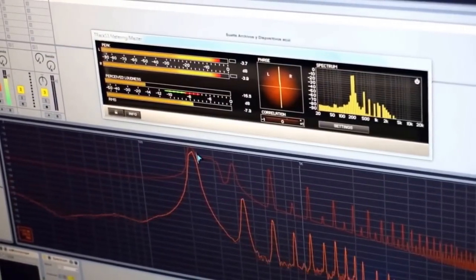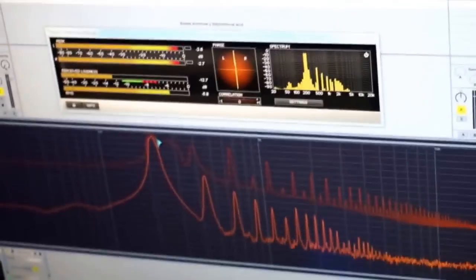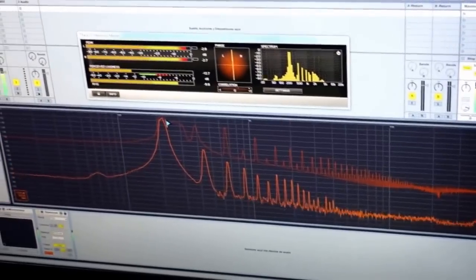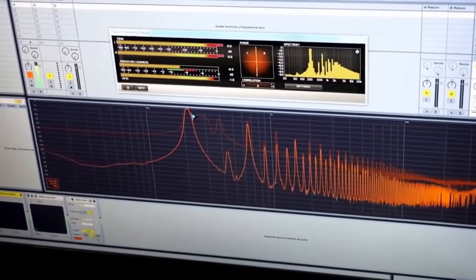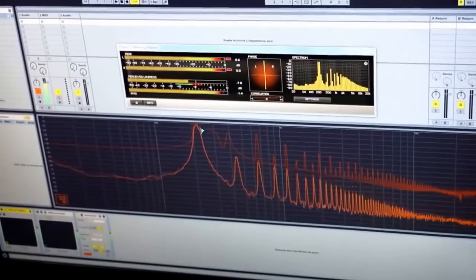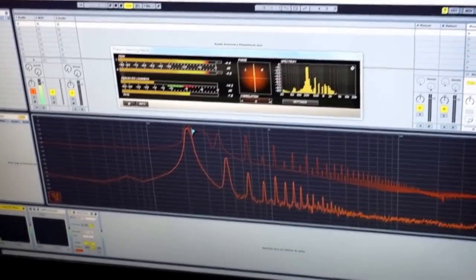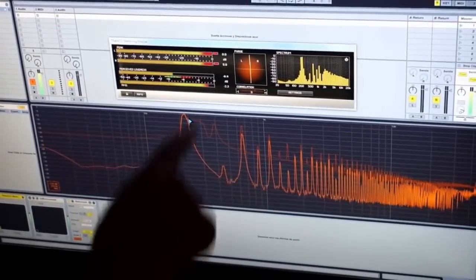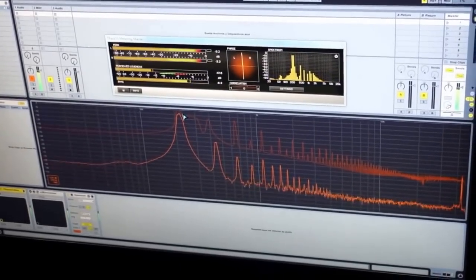When you produce a sound, they are very well balanced. I'm not passing any gain to the tubes right now. Now I will start building this up — then distortions start happening, and I haven't even reached half of the pot. Right here it's completely distorted. You can barely use the full range of the tube, and I'm at half volume right now. At full volume I'm maxing out my meter.